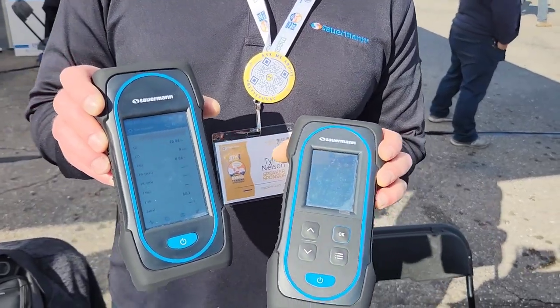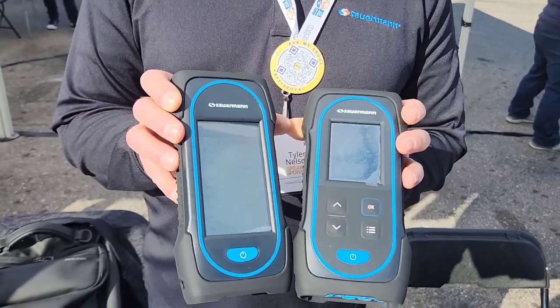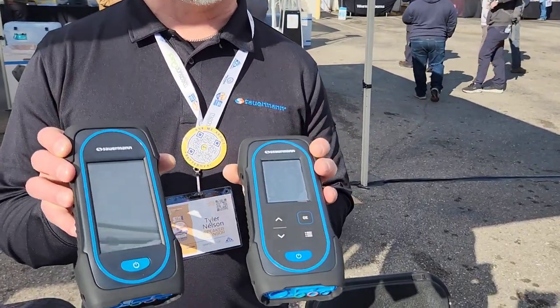But what makes these sensors last so long? Basically, we went and spared no expense. We actually sourced the most expensive sensors on the market, and we didn't gouge the marketplace for profitability. We know what it takes to make a profit. That's why these come in at a very competitive price. An additional feature is the CO threshold — we're giving you 8,000 ppm. But we do you one better: you're never going to spike a CO sensor with these because we have programmable pump cutoff that you can customize so the pump turns off and you never overrange your CO sensor. That is so important because if you stick it in a stack and that stack is not burning clean, you can actually break your combustion analyzer on the job on a unit that really needs you to be able to use a combustion analyzer in order to fix it.